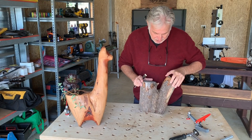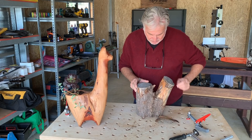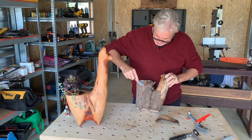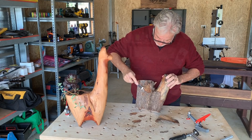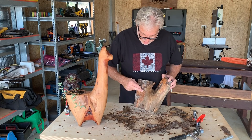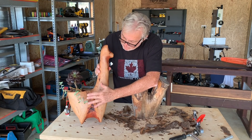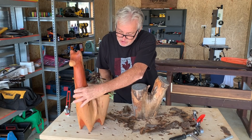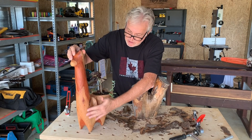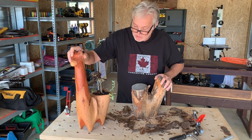One of the first things to do is get off all of this bark, because there's a bit of sand and that attached to it. And then I'll use the bandsaw to cut this section off here and bring it up to a similar sort of shape. Just a little tip when taking the bark off: try not to damage the underlying wood, because this type of sculpting you often leave exposed wood, particularly with this type of carving where you're doing a minimal amount of actual carving. So the actual surface of the tree itself, the wood, is actually quite important.